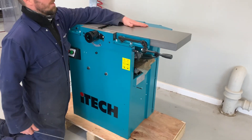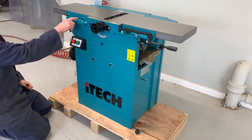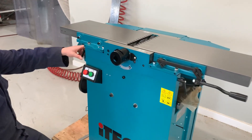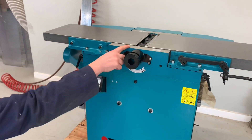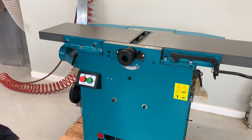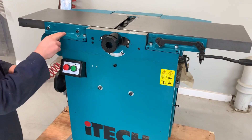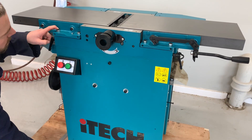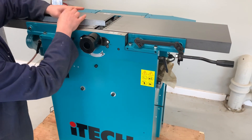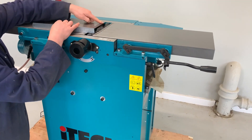Now we'll set the datum, the in-feed on the datum side. Now we're going to the outside of the machine, which is adjusted by these two screws here. You have to remember the lock — that should pull it down and when you tighten it fully it shouldn't tilt the bed at all. So that's come down, sit flat, and that's it. Obviously a little bit goes a long way. Put the spanner on there, adjust the screw, release, check it again, and you want it to be just hitting your rule as it is on the datum.